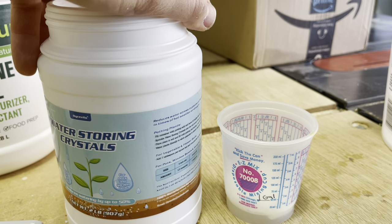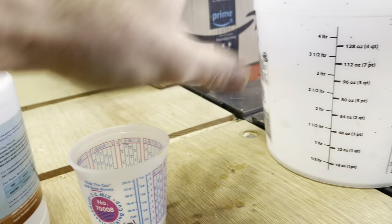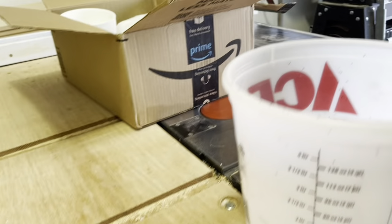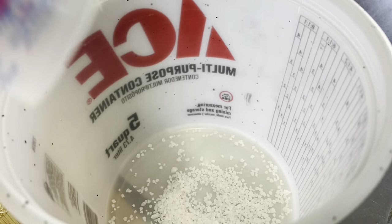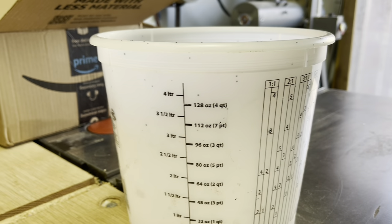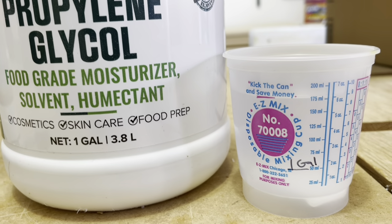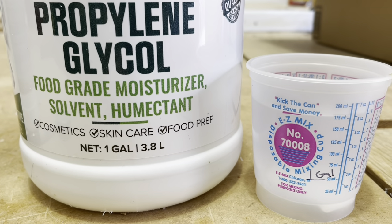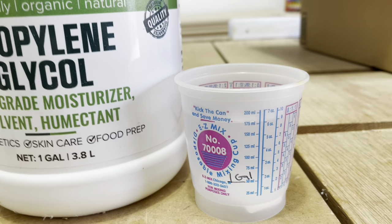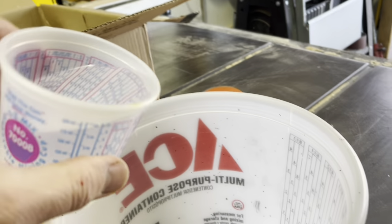The conversion to make the right amount of gel is one teaspoon per 550 ml, which is basically a half liter. I'm going to make a half gallon of mixture, and I did the math to come up with 25 milliliters of sodium polyacrylate. I'm going to use the bucket to do this instead of the pipes, because then I can mathematically calculate what percentage it rises when it freezes, to know how much I can fit in those pipes. The conversion for propylene glycol was 90% water to 10% propylene glycol — roughly 6 ounces of propylene glycol to 60 ounces of water to get to our half gallon.